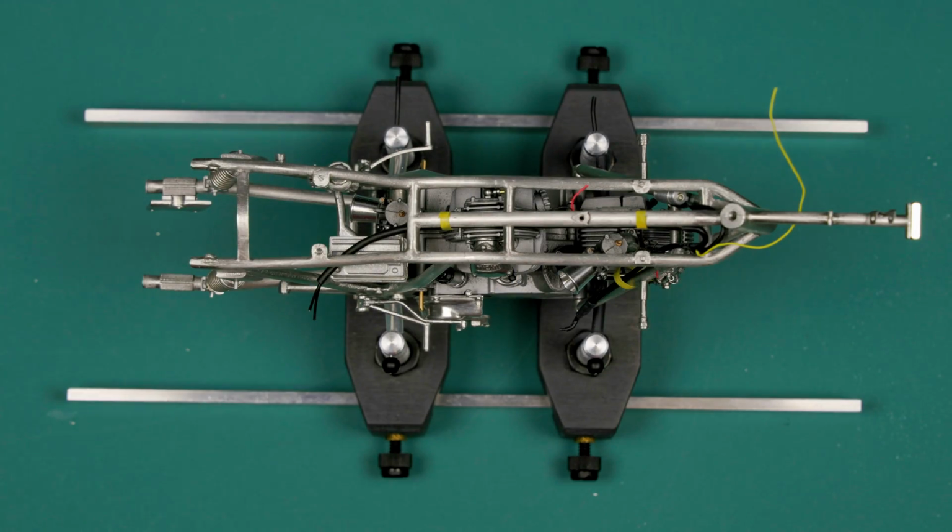All right, so there we go, a little demo of me doing some soldering. Hopefully the footage turns out decent. It's kind of hard to film in my spray booth, and I don't think I touched on that. The reason I do my soldering in the spray booth is for the fume extraction. So obviously the fan's going, getting rid of any fumes. I don't really notice fumes when I'm soldering white metal with the low temperature, but I'm using acid. I don't want to take any chances.